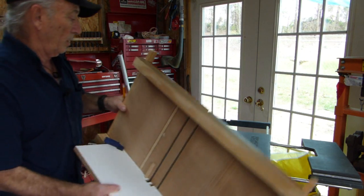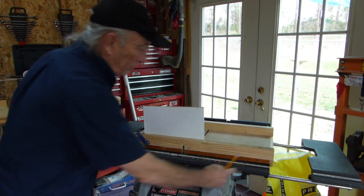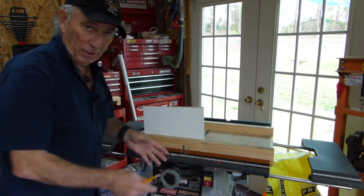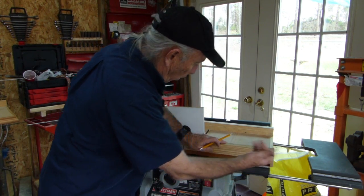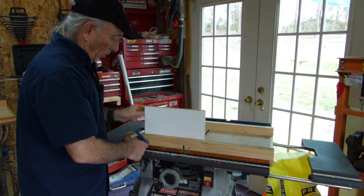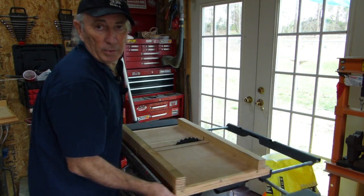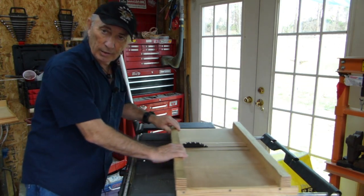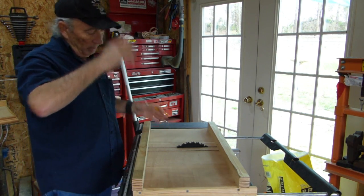This one's actually still set up for notching out something. Here's what I did: I measured across and cut up an old coffee table to length, then just added these strips of hardwood — oak — on the edges, on the sides. I've started building, though I haven't finished my bridge yet, so this is still a work in progress. This is the crosscut sled. It works — I can slide it through, put my pieces of lumber here, and cut. It's a great little crosscut sled and there's no play in the sled, but it slides nicely back and forth.